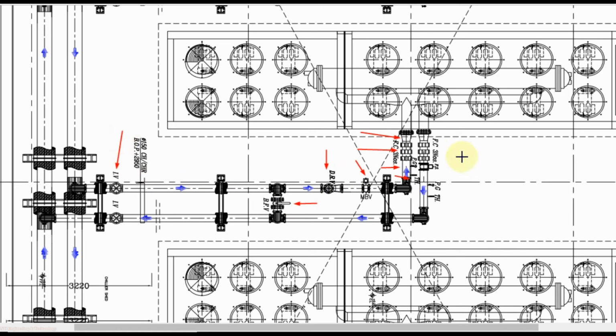For the supply also, first we will use the reducer, then flexible connector or flexible coupling, then flow switch, then pressure gauge, temperature gauge, and at the end isolating valve. We have not used here strainer because we already use strainer with the primary pump that is supplying chill water to the chiller. Use of motorized valve in this valve package.